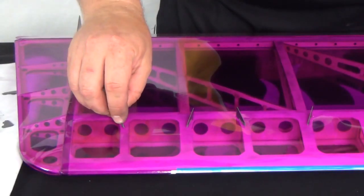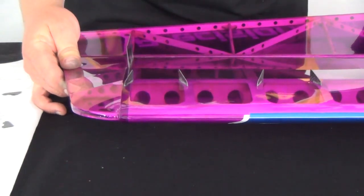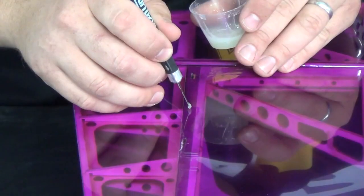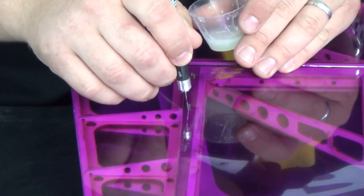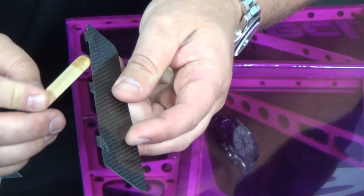Now do a dry fit of all the Vortex generators. The slots shouldn't need any further adjustment unless the VGs aren't standing perpendicular to, or won't fully seat on, the wing's surface. Then remove them again. CA will fog up the covering, so mix up some 30-minute epoxy and apply it to both the wood slot's interior and the carbon fiber tabs.